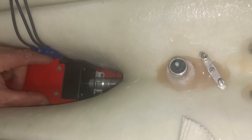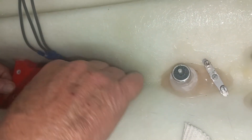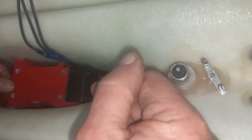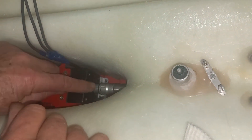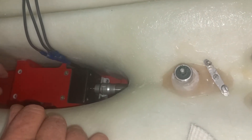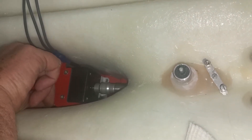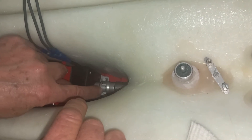Right, now you can't run the motor for a long time when the shaft is in the drive shaft housing, because the seal at the end gets hot and if it gets too hot it will melt, and that will allow the boat to leak. So when you're running the motor up — when you've got the grease — you don't do it when it's in the boat. You do it outside the boat. When it's finally fitted in the boat then you can just do a couple of those. Okay, now we're going to bolt everything up and I'm going to explain to you how to adjust this coupling.